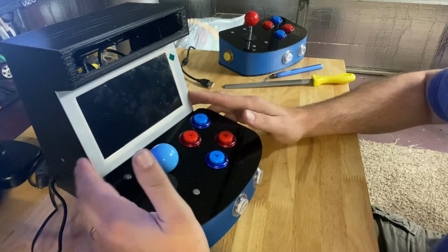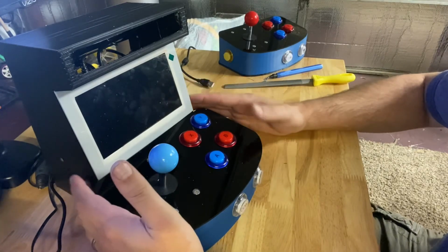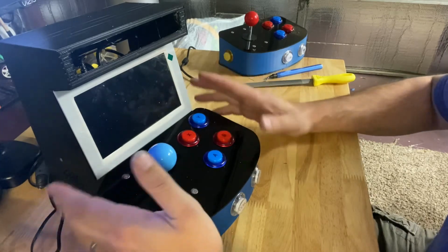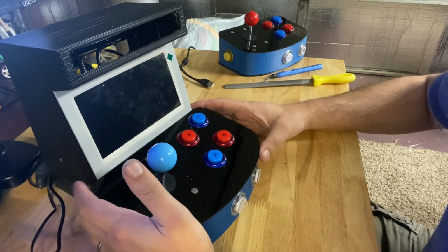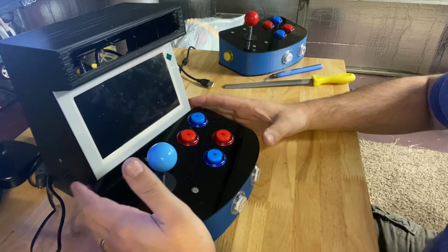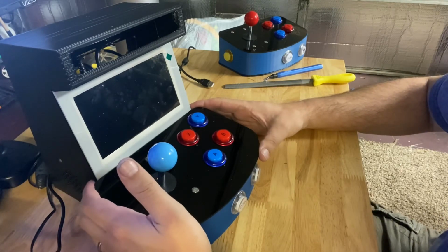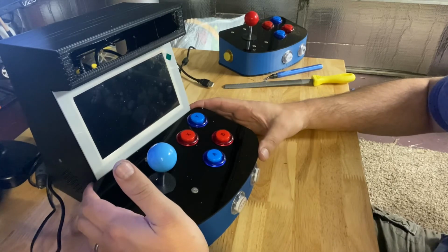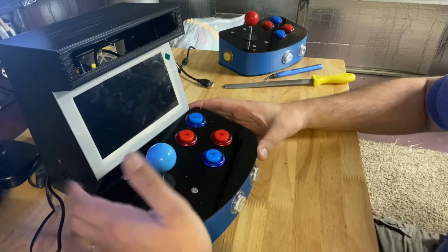This is power hungry. The screen LCD, as you can expect, probably requires the most milliamps out of any of the components that we're adding to our Retropie system. So keeping in mind your total throughput for your USB connections off your Raspberry Pi, even off a Pi 4, is 1.2 amps. I had to cheat power to this LCD.